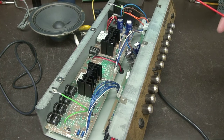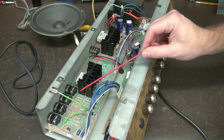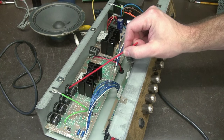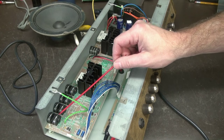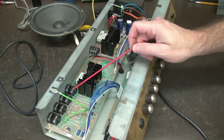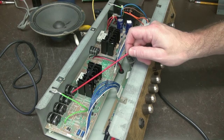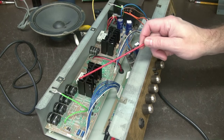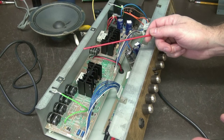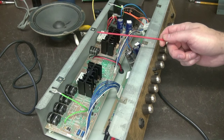Normally when these come into the shop with this situation, I usually go right to these output jacks here. These are your send-receive jacks, there's an audio-out jack. But the culprit usually is the receive jack — these contacts right here become a little bit corroded, and you lose continuity, and it kills pre-amp signal. Well, I checked it. That's not what it was, so let's move on.